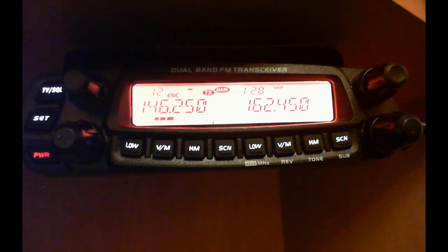Hello again, everyone. I now have, anyone can see whenever I get this video put up, this interference that I keep mentioning on the repeater from time to time. I can put an individual on reverse side and hear them crystal clear, but when I come over to repeater side, I can barely understand them. It sounds like I'm getting distortions, and just now I was watching the signal fluctuate from full scale to dropping 3 or 4 bars and getting real noisy. So I don't get that on the handheld in the house or on the scanner. Apparently I'm picking up something on my J-pole, and this is the only repeater that it does it to. I don't really understand that. So apparently somebody or something nearby is causing me some problems with this.